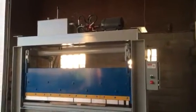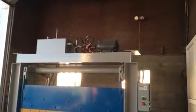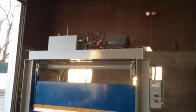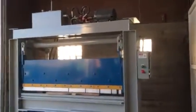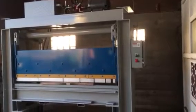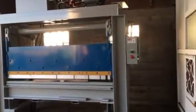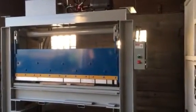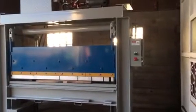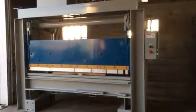It's an 8-foot hydraulic. It features a 20-horse electric motor at the top there with a 25-gallon-per-minute vane pump and a 30-gallon tank that I built. The mainframe is built out of 10 by 10 by half and three-quarter inch H-beam type material. I found a used set of dies from a machine shop that no longer needed them and I cut them down to fit my needs.